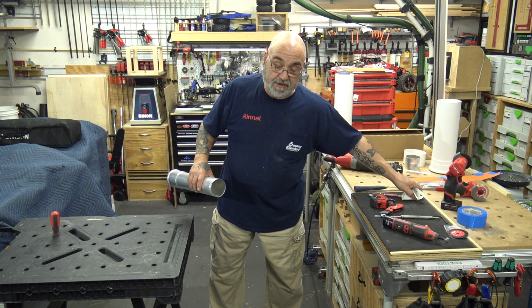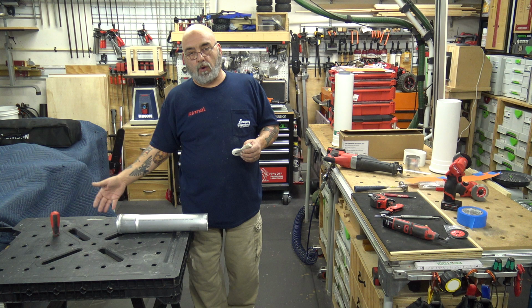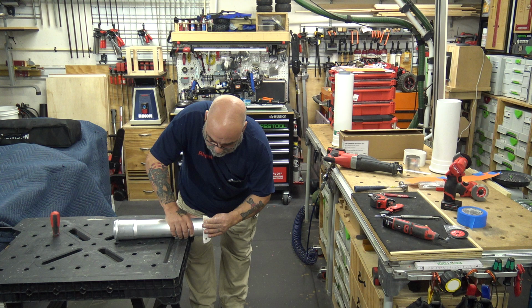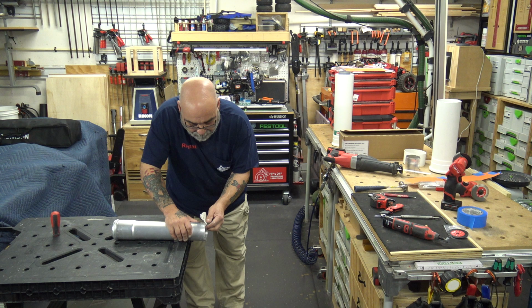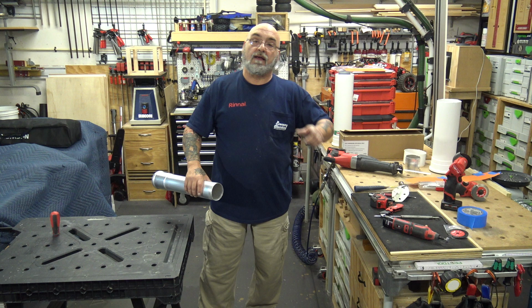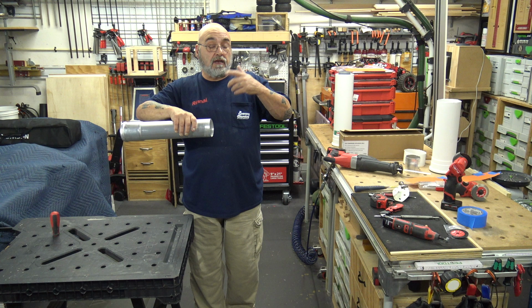Now what you're seeing is the exact amount of time, minus say 5 minutes off this, because I would have my son here actually holding it, and we wouldn't be messing with such a big Sawzall. But again, you're most likely going to cut one or two of these pieces. Be patient and slow, because it's very important to have this correctly cut so that the engagement inside of the pipe is correct, so you're not mixing the gas and coming back around and having the fan suck it back into the burner, using carbon monoxide as air for combustion.